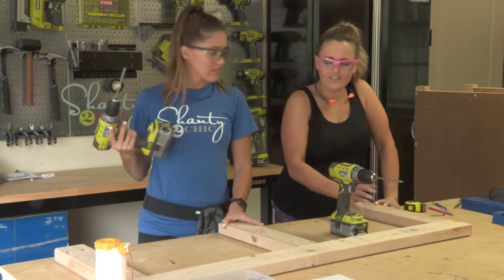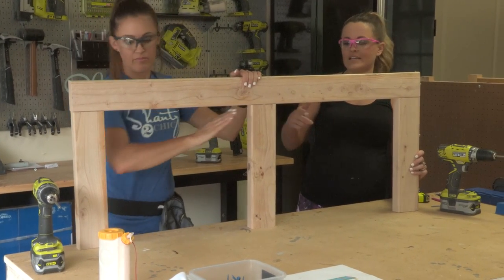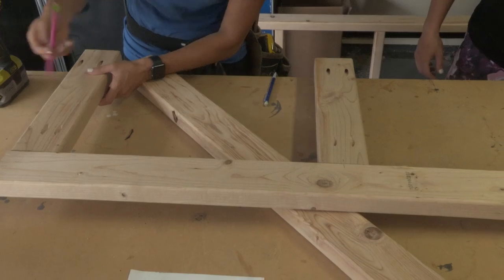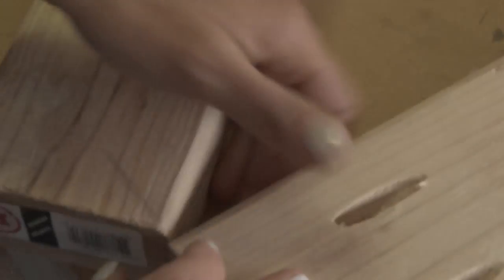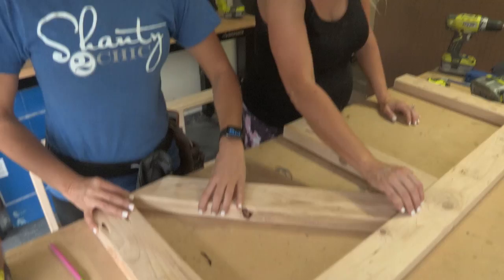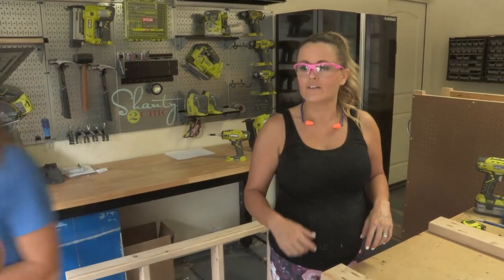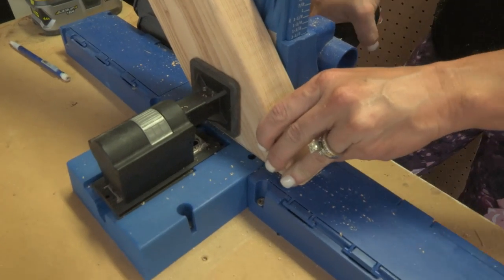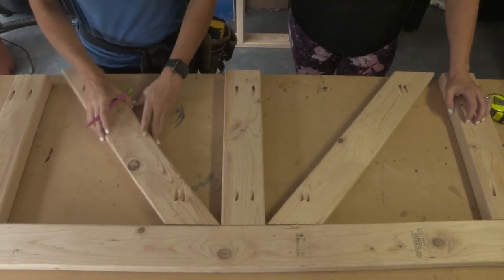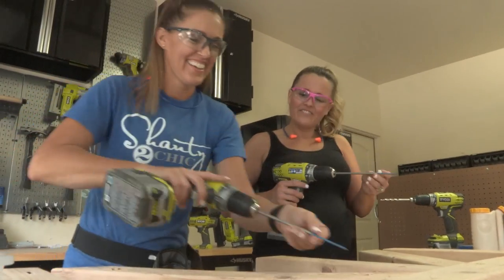Fill those later — that makes the front of the swing look really good. We are going to hold a straight board up to these and mark where we want to cut those diagonal pieces. We'll put a 2x4 underneath the back that we've assembled and mark where we're going to make those miter cuts. Take that piece, trace it onto the next piece, and make the exact same cut. Once those cuts are made, add pocket holes to each end — make sure that the angle end of the board sits flush on the Kreg jig. Then attach them to the swing back at the top and middle using two and a half inch pocket hole screws and wood glue.